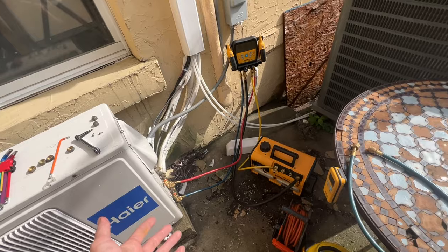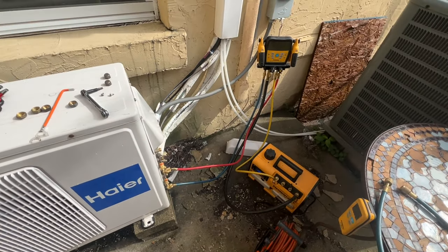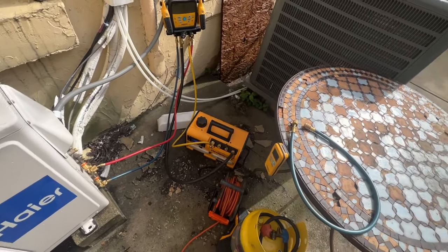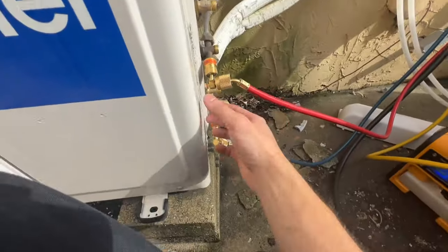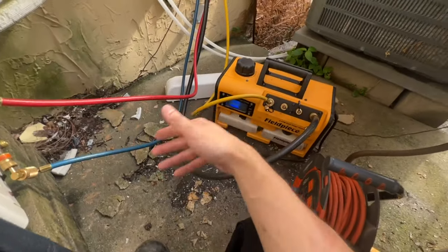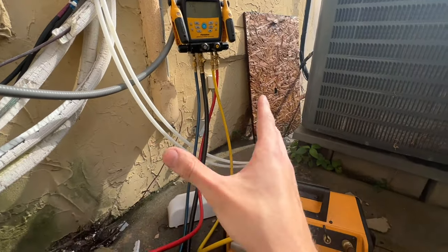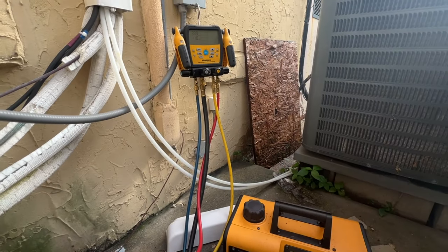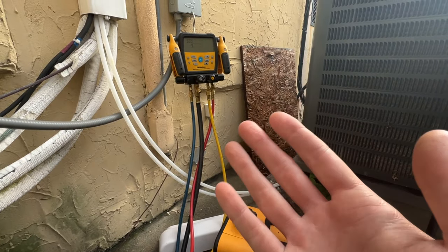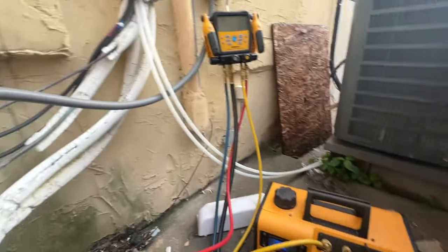You can see we're not doing the normal vacuum procedure with the true blue hoses, just because it's such a small line and we're not aware of any leaks. I don't believe there are any leaks — pressure test is okay. I'm vacuuming through the manifold using two hoses. They're all new hoses along with new adapters, so I don't think there's really much of an issue, aside from it possibly taking longer because I'm pulling through the manifold. We are reading from farther away from the farthest end of the system, so when we do our decay test, we'll just have to make sure it sits and stays for a while rather than rising up super quickly. We're probably not at 388 microns — probably much higher — but we'll give it some time to pull down, and then we can add our charge if it passes decay.